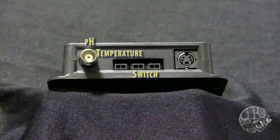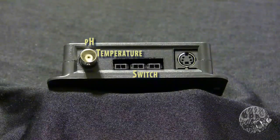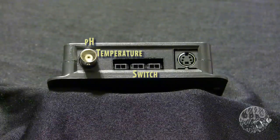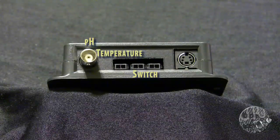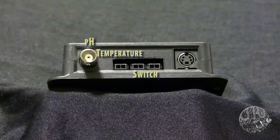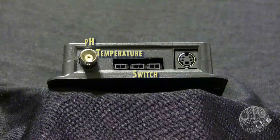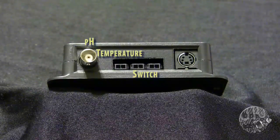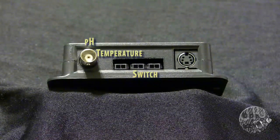If you have a reverse osmosis water storage tank and a top-off tank, you can measure the depth of the make-up water and when it gets low you can transfer by pump from your storage to your make-up for just two minutes. This would give you a fully hands-off implementation of water management. This is just one example of something you could do with a switch trigger.